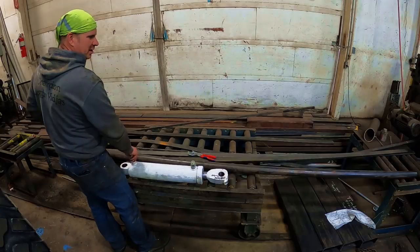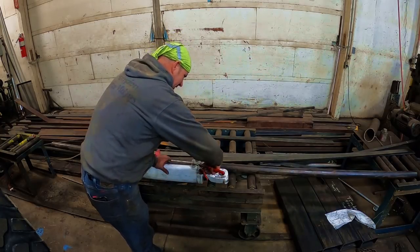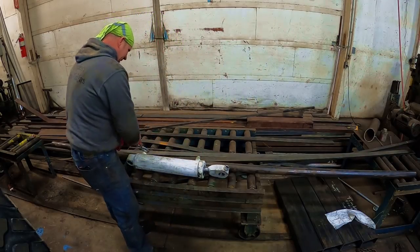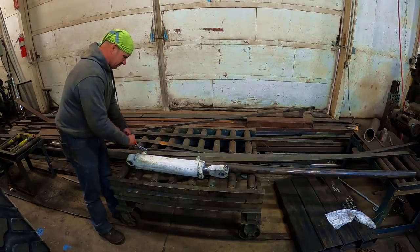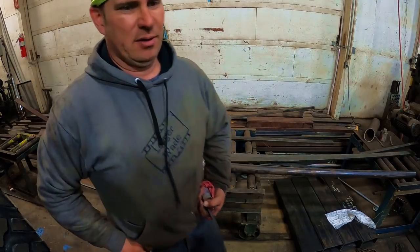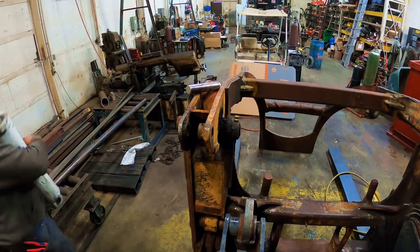All you gotta do is make sure that O-ring's in there and you can beat them with a sledgehammer and they're gonna be fine. Now, on a JIC fitting, which is kind of the compression fit style fittings, I don't like them so much because one little ding and they're loose. But it's taking a lot of people some time to change over from them, but I'm telling you, these flat face O-rings are superior fittings to them JICs. And I guess that's my opinion, but that's my opinion based off of proof. I'm telling you, this is the way to have it.